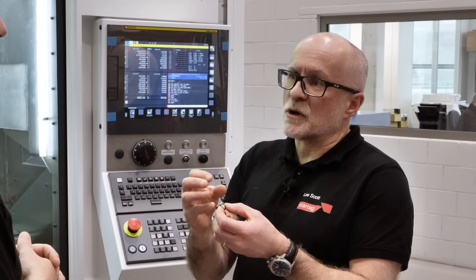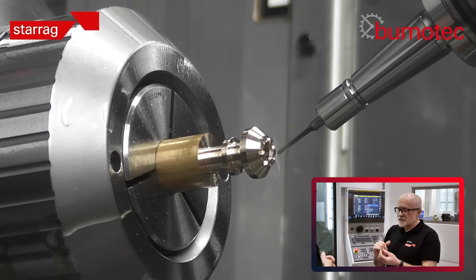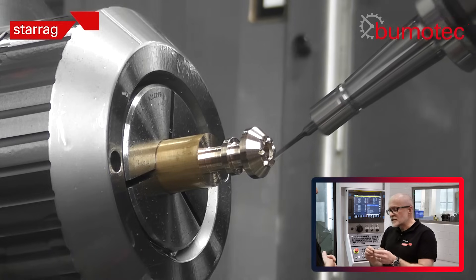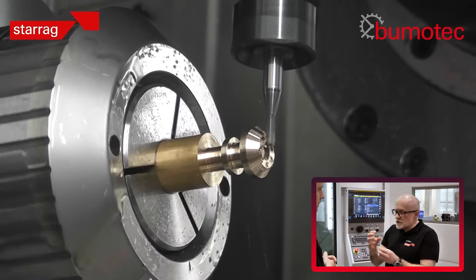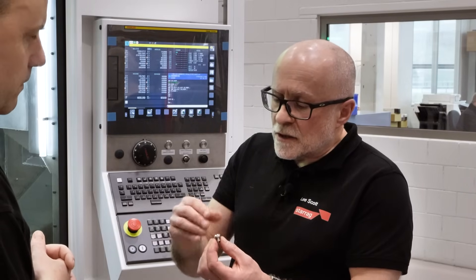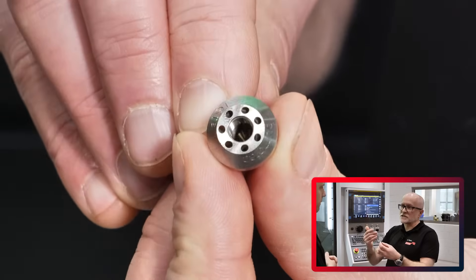You've got to prepare the start, drill the hole, and have no exit burrs — but also not deburr the hole or round the edge; it's got to be a perfectly clean exit. We grind the surface after the holes are in. On this component here you can also see very small slit slots. There are lots of challenging features, and the fluid has to flow cleanly — you can't create a vortex from a step in the surface.